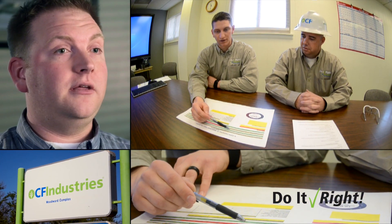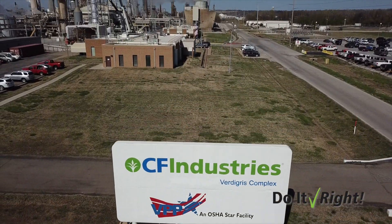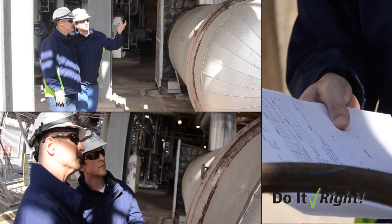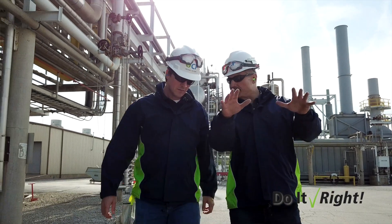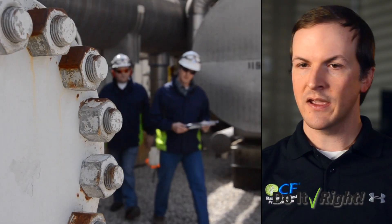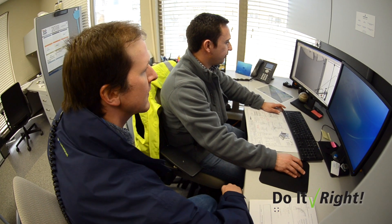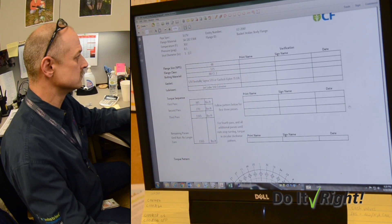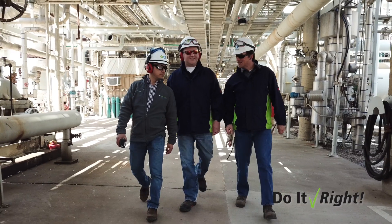We worked synergistically with Woodward and Greg's team to help develop this program and implement it at this site. The whole purpose of my position is to identify potential failures before they happen, ferret out the root causes instead of just addressing the symptoms, and prevent them from happening again. We've had misalignment on a flange caused by over-torquing on one side or over-crushing the gasket. What we discovered is that we were really relying on technician expertise to know how tight to go, but we were actually over-stressing our flanges — going tighter just made it worse. We had a systemic gap both technically and in getting this information to everyone in the field.